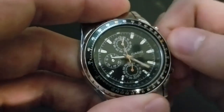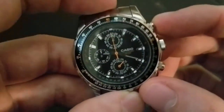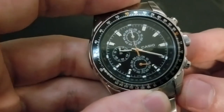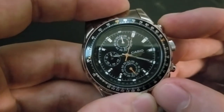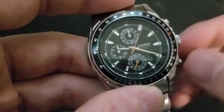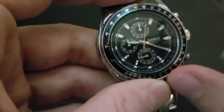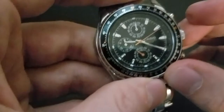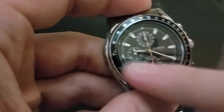To set it, pull the crown and set your time. To use the stopwatch: start with the top-right pusher, pause with it again, reset with it. There is a click when you first start the stopwatch; however, when you pause it, there's no click. The reason is that starting it also releases one of the sub-dials. When you go to reset, there is a click because it's resetting the two top dials.